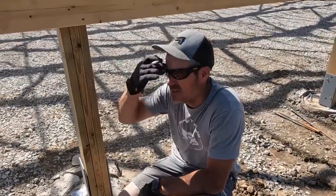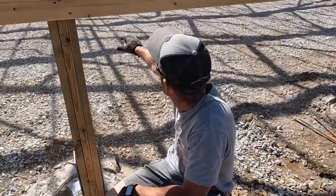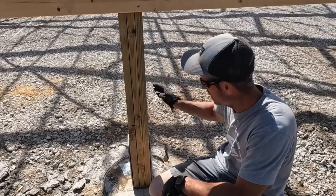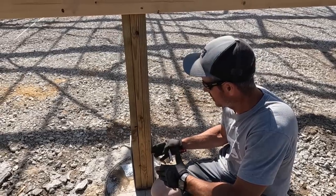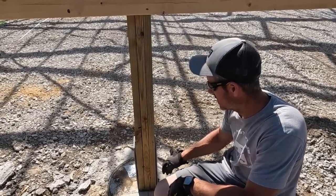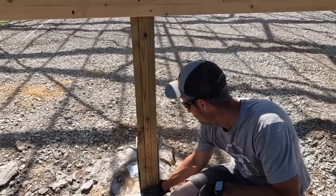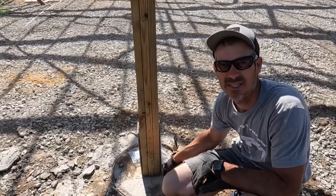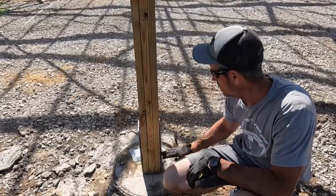All right, so as we're putting this other end wall up, I'm measuring across to the column parallel with this one, just to make sure that, this building's 80 foot long, so I wanna know how much I need to set this out. I do have this line, but when we poured this, there was some water in the hole, so we didn't get a really clean line like I like, so I just wanna make sure.